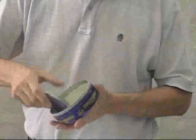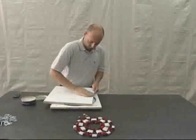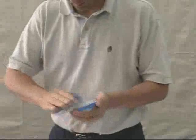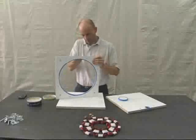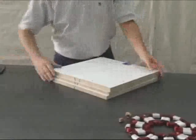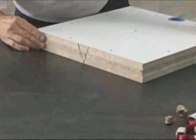Use your favorite automotive car wax as a mold release and thoroughly coat all of the parts of the mold. Put a mark on the edges of the parts — this way you'll know how it goes together later on.